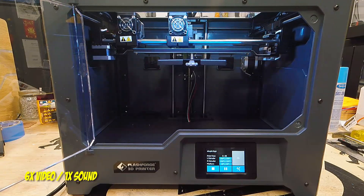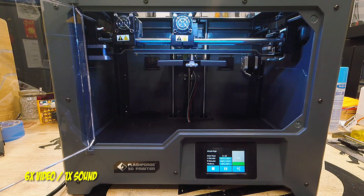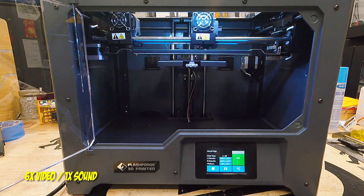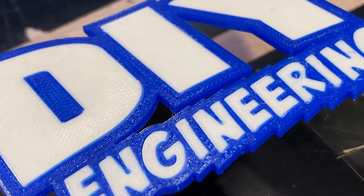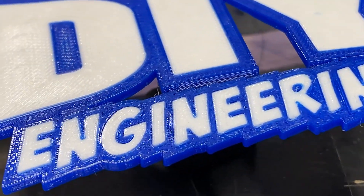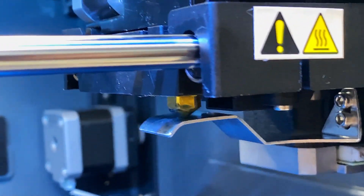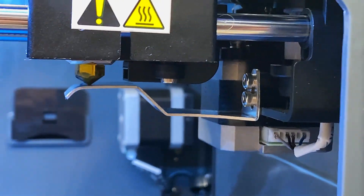The printer is relatively quiet at 55 dB while the shop's ambient noise is around 46, so it's not much louder than the ambience — the enclosure helps with that. Once the print was complete, the printer did a pretty good job. The wipe towers did a reasonable job at keeping the colors from contaminating each other. One unique aspect is the special wipe pads that the extruders rub against to ensure there's no ooze when idling.